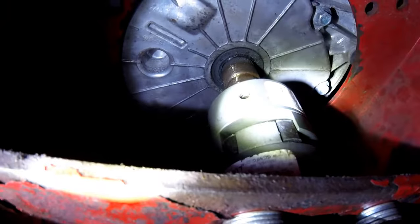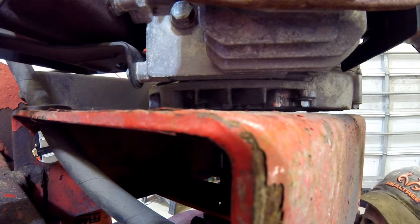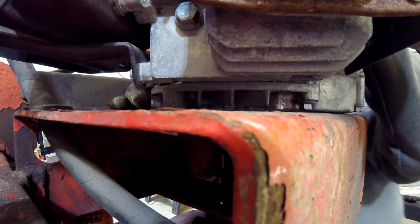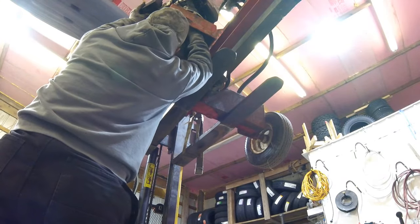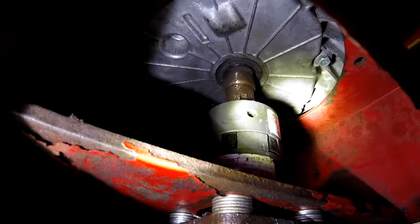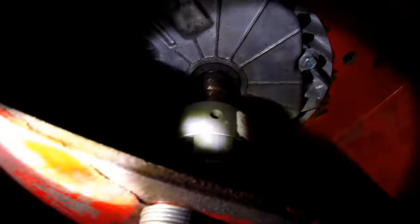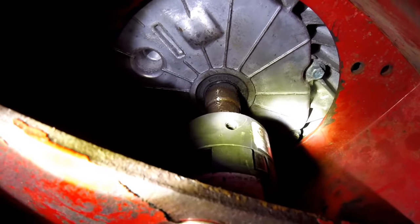Now you can see we've just about got the two assembled but there's a little space, so we have to make sure the motor sits straight down squarely. I'm going to line up the holes with my previous marks and put in the bolt for the motor. I tap the coupler down the motor shaft until it's touching the other coupler with the spider gear in the center. All I have left to do is tighten those two Allen set screws on top so it doesn't wobble or loosen up on the shaft — and I'm all done with this project.